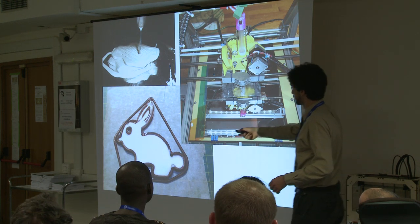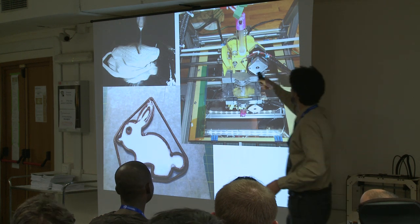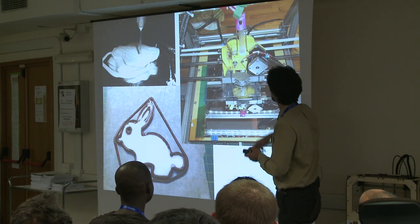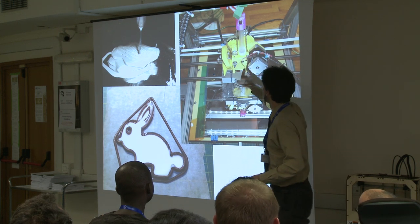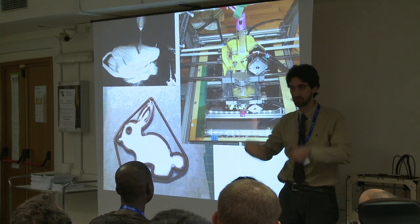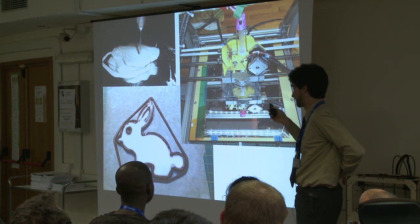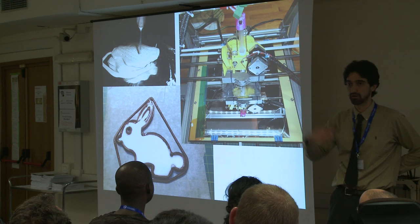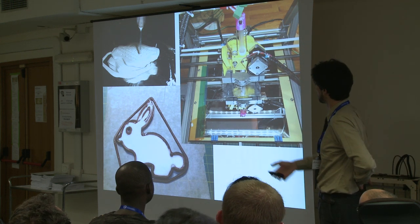And then chocolate extrusion. And with syringe pumps, basically this is a syringe with a belt all over it. The motor just pulls the belt and the syringe extrudes material. You can use this technique for ceramics, for sugar, for many other kinds of materials.